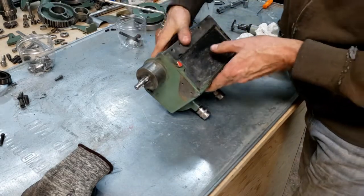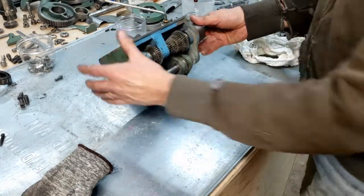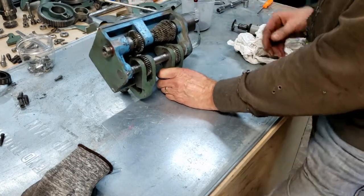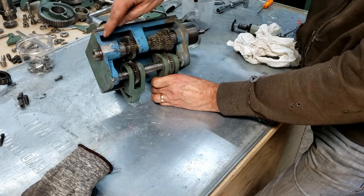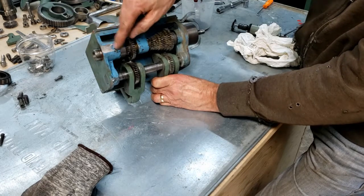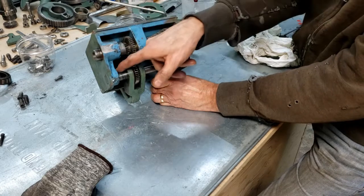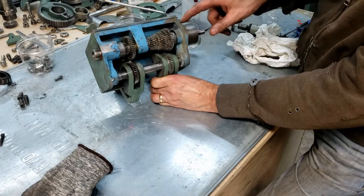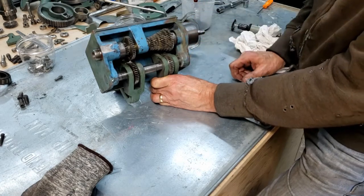Well, that's happening. Let's have a look at the other side. Now, oiling this. The oil coming in here goes through the gallery there over to this side. Obviously lubricates there. There's a galley way here, comes down here. Some wicks in there. Bring it over. Same thing on this side, galley way here. A couple of wicks there.